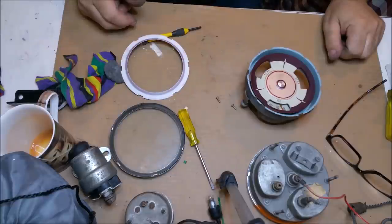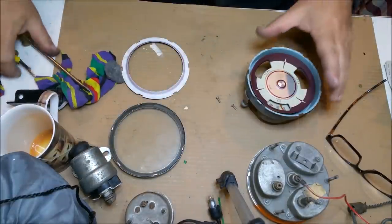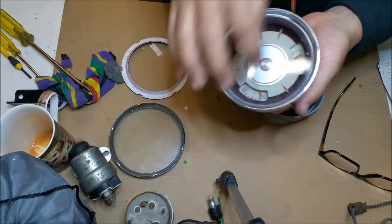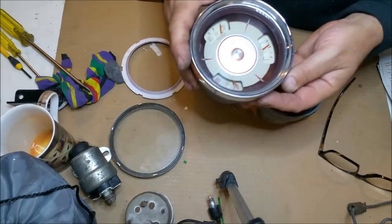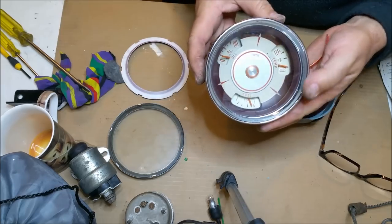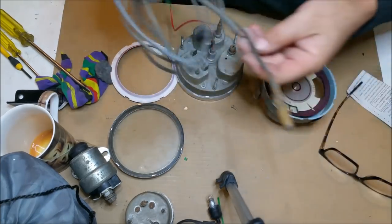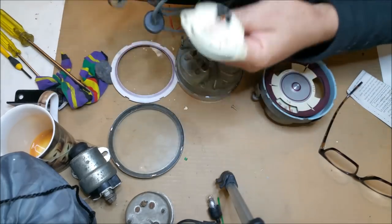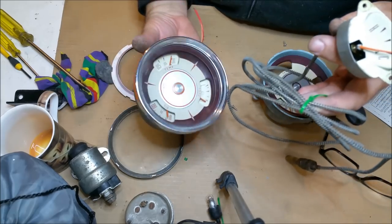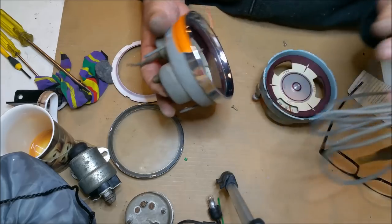Well, let's try again with the camera pointing the right way. I've got this 2480 one here. That's what they look like, complete. That oil needle's bent. It's always been like that, at least in the time I've had it. The instrument would sit like that. The temperature is controlled by a capillary tube, which looks like that. So you dunk it in boiling water and the needle comes up. That one's actually different. There could be Mark 1 and Mark 2 differences, I'm not sure, but that's actually got the temperatures in there, whereas that's just high to low.